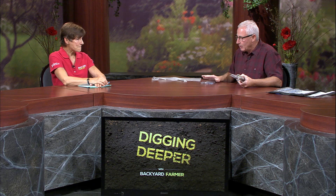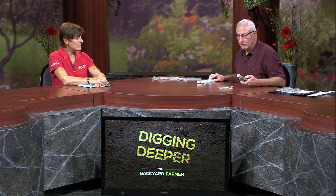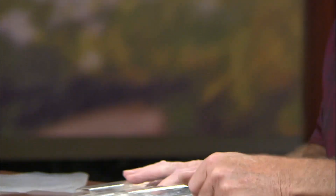It sounds complicated but it probably isn't, especially if you've ever built anything out of Legos. I would invest in the polycarbonate because you can fairly easily put it on — on my greenhouse it's just screws holding it in place. When you're really investing in the structure you want this product, which has 25-year longevity — you're treating it like glass, just what you are. I do want to caution people: also available is a single-layer corrugated polycarbonate. Notice it's corrugated, giving about 30% more surface area, which adds to your heat load — plus it's a single layer.